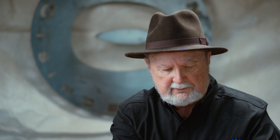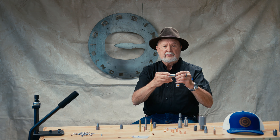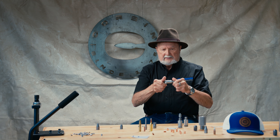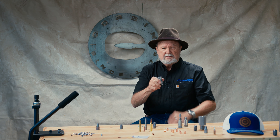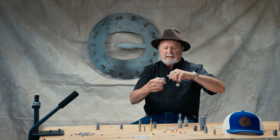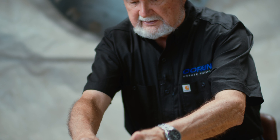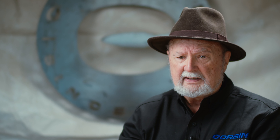The main difference is with a lead bullet, you can usually mix them all in one die because there's no blocking of any bleed holes. You can have bleed holes like this die — it's got a bleed hole on the side — so you could form an airgun projectile, a shotgun slug, or a black powder rifle bullet with this die alone. Push it in with the punch, push the lead in, and adjust the weight so it bleeds off anything surplus. With a jacket, you can't do that because the jacket would block the hole, so you have to adjust the lead core first, then put that in a second die and squeeze it into the jacket, then take that to a third die and form the point — so there's usually a three-step operation.